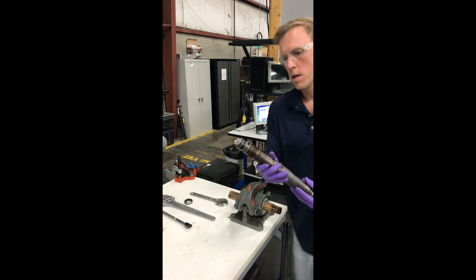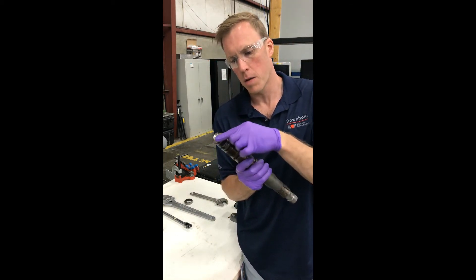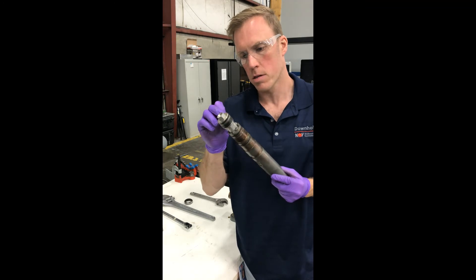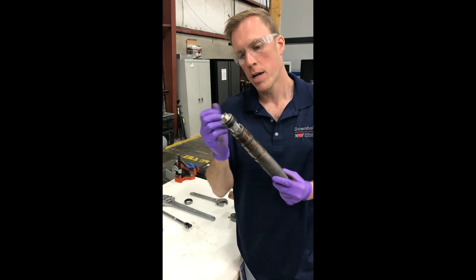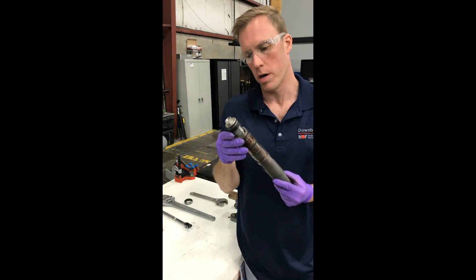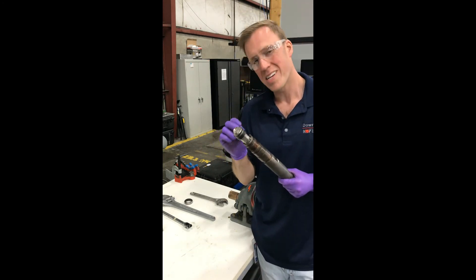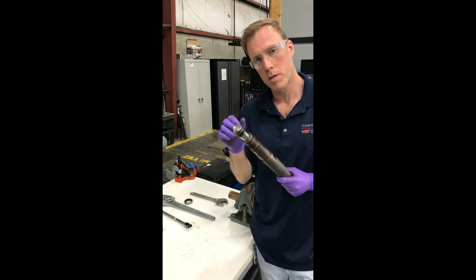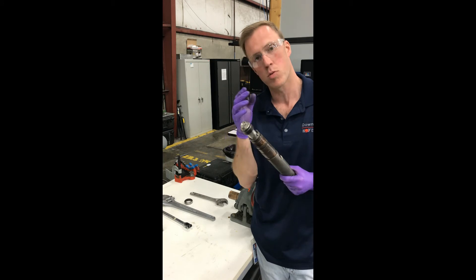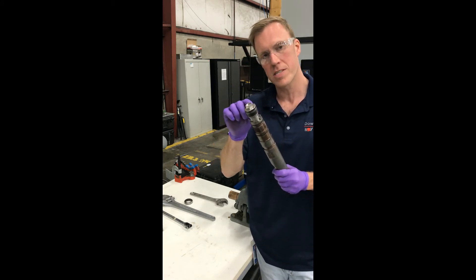This is your signal shaft and helix. You can see all these poly packs — there's a direction to those poly packs, and there are some grooves to help get an o-ring pick underneath them. There's one poly pack on the uphole side flared upward, and then three on the downhole side flared downward. It's very important to note that poly packs come with an o-ring inside. When you replace those poly packs, you want to de-load them — pull the o-ring out and discard it — and simply use the poly packs without the o-ring. The manual then has you taking this cap off the signal shaft.